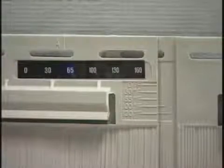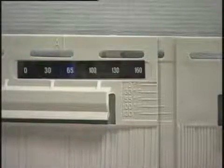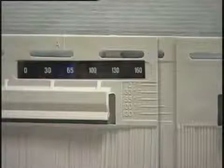Rough split shakes must be installed over sheathing with nail holding strength, such as 7/16 inch plywood or OSB. Before installing the first course, we'll cover panel spacing. Rough split shakes expands and contracts like other plastic siding, so it's important that the panels be spaced according to the panel temperature at the time of installation. Otherwise, gaps will be too large or too small, creating the potential for dislocking side tabs or distorting or buckling the panel. Panels installed previously at different temperatures do not require adjustment.